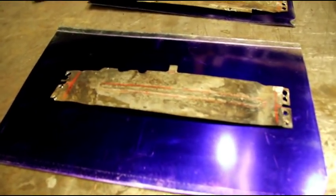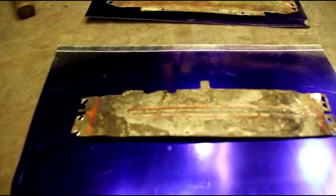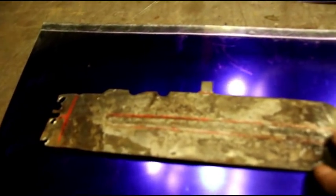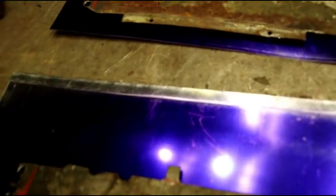Okay guys, you've seen me do this a bunch of times. We've got some 26 gauge material on the bench, and that's what the original shroud is made out of. And I've got the pieces flattened out. We got the bead profile already established before we flattened it out. And we're just going to trace around there with a scribe, get our blanks cut out. And this one we'll put through the slip roll. This one we'll put a flange on, and we'll go over to the kick shrinker and get that into shape. And then we'll put the beads on afterwards.